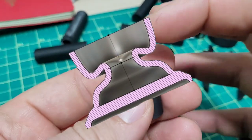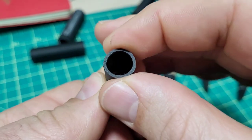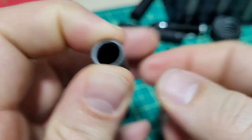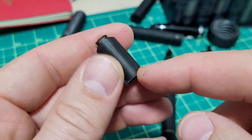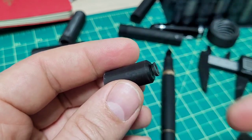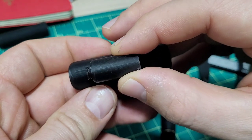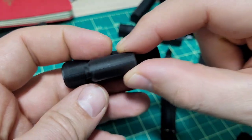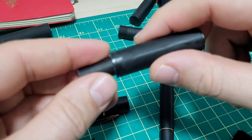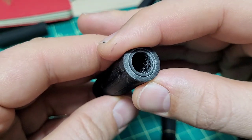I did a quick drawing to have that kind of profile. The resin does have some give — this is the broken one; I wanted to see how much it could take. I'm going to have to adjust wall thickness and design the part to accommodate the material, and maybe change exposure settings. That's essentially the profile for the next rendition to replace the spring. It'll go into the pen with some spring action — push down, then when you push the pen in it pushes back up for that tactile feel and seal. There's also going to be a little feature that self-retains this part inside the pen.